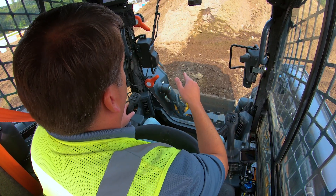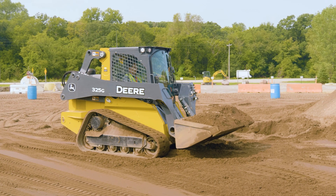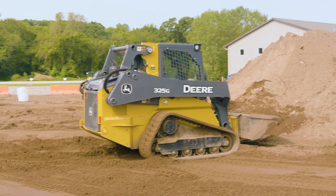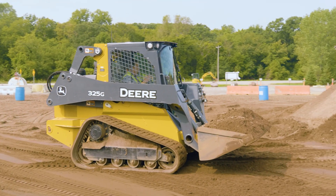So to spread - we're just doing sand and dirt here, but typically it's going to be gravel. There are two different ways of doing that. Obviously you want to start as far away from you as you can and work your way backwards, because it's easier going out and then cleaning it up as you work your way back. When you come back to the pile, try and make your turns in that one spot. If you're doing a bunch of turns all over the job site, you're going to be disturbing and breaking up the ground. Instead of making all these turns, try and keep it clean - wherever your spoil pile is, pull back, do a gradual turn so you don't tear up the ground too bad, then go straight to where you're going with minimal turns. That's going to avoid tearing up the ground.